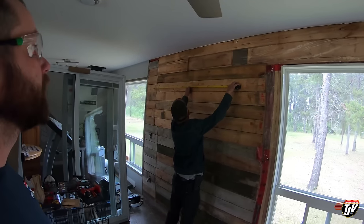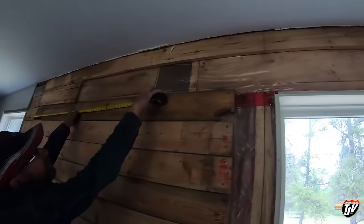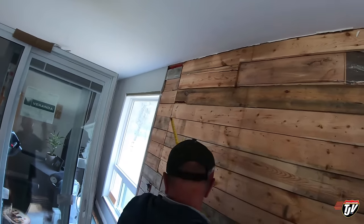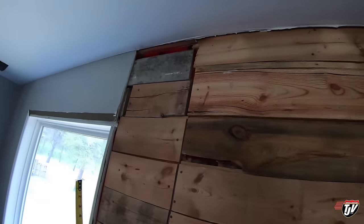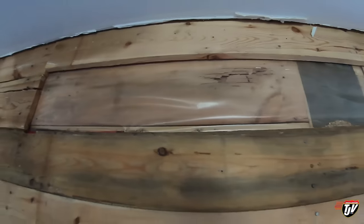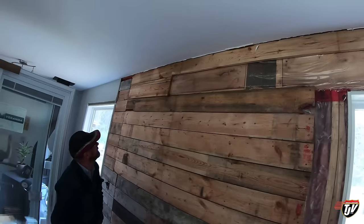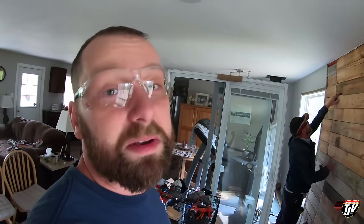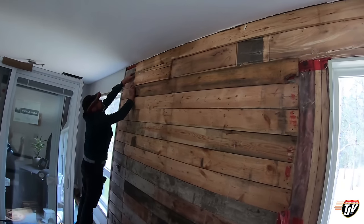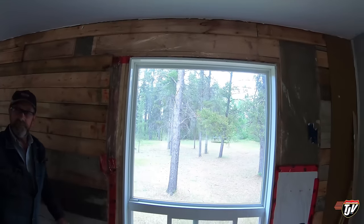It's probably not big enough — that header looks a lot smaller. This header is gonna be just barely big enough, just a couple inches too long. It could have worked, but it would have to reach past that, and there's definitely no more header back there. It probably goes right to this edge here — maybe 55 inches or so. We need 60 inches, so that's too small anyway. But we know there was a header there at one point for some reason. This side goes right through — this one's too short. That's fine, this was the original plan anyway.